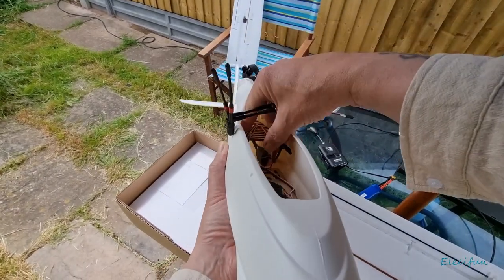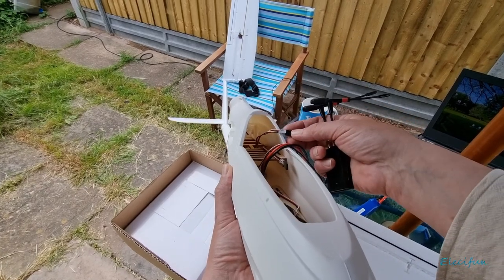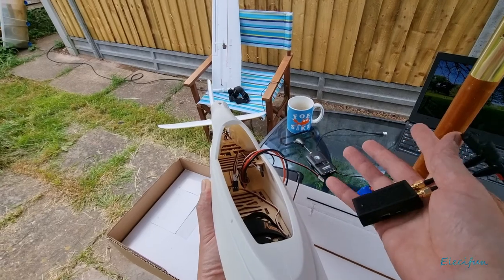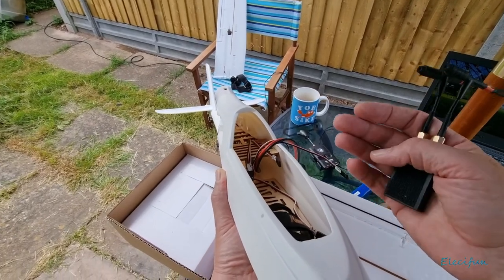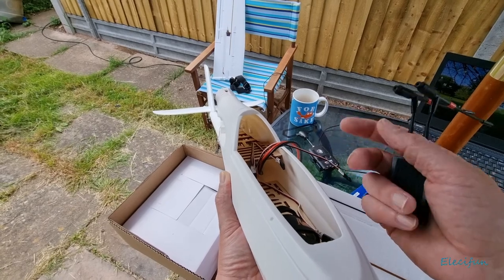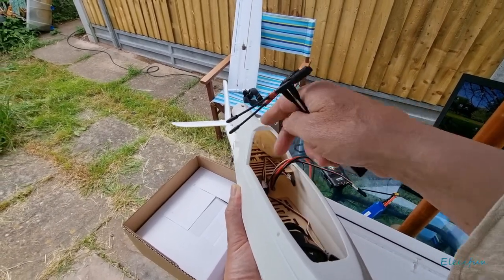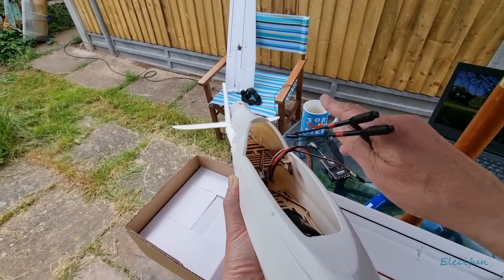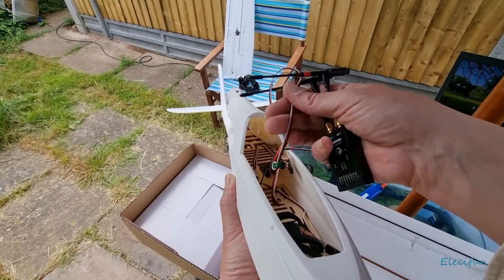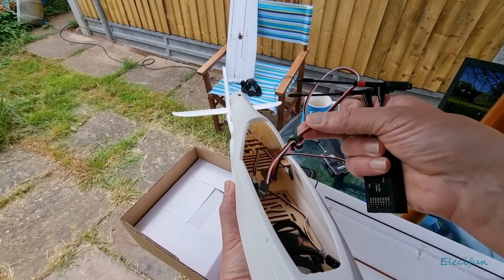I need to be able to connect these wires. There's a double one here for the ailerons, which means they can go from 1500 up to 2500 or down to 500 - a thousand either side. That's probably all I'm going to use for the ailerons because as one servo goes one way, the other goes the other way. This one's got the choke on it, so that's for the power - the signal feed giving five volts from the BEC on the ESC to power this.